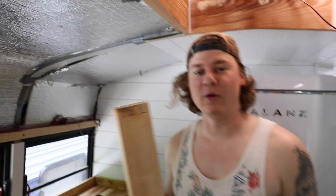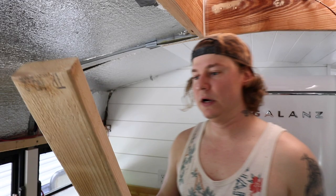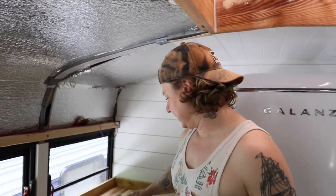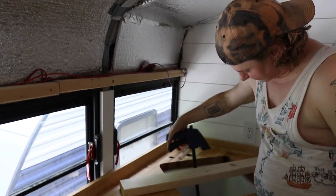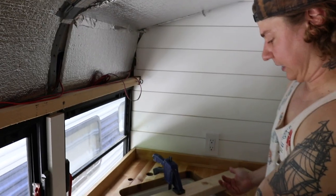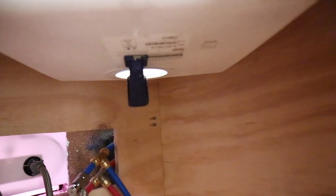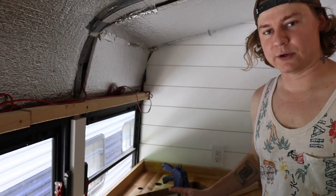So far today: Scott has already mounted the undermount sink and is now working on installing the kitchen faucet. One quick tip — I was having a hard time mounting the undermount sink by myself. What I ended up doing was getting a 2x2 board and a clamp, putting the clamp through the hole of the sink, and using the clamp to pull the sink up to the countertop so I could get underneath and install the brackets.